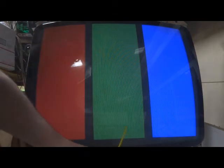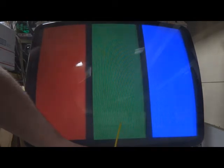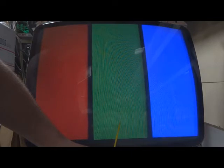Now if you notice when I turn this contrast up, you see how they smear? That's what they're supposed to do. They're also supposed to smear evenly, which is exactly what you want. Now we'll play with the sub-contrast pot a little bit, and we'll turn it up. See how they smear? Now if you want it all the way up max, that's fine.